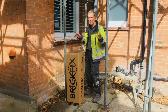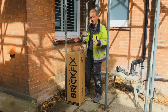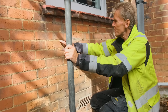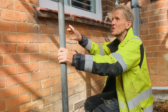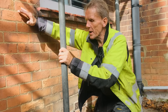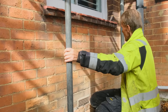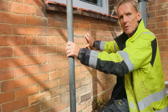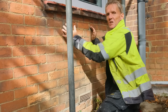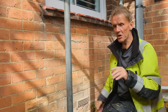The thing about cracks is you've got to look at them — if they're major cracks you may want to get a structural surveyor in to have a look at it. Now this is very common to find cracks under windows, and the reason that happens is you've got a lot of weight on the building either side of the window but no real weight in the middle, so if there's going to be any movement this is your weak spot in the panel underneath the window.